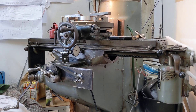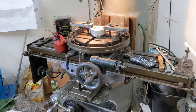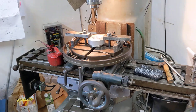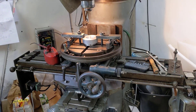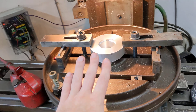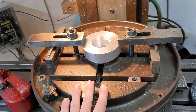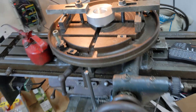The little bit of backlash would mean the holes aren't quite where they need to be. I was going to go around my mate Matt's today and borrow Optimus Prime — his CNC Bridgeport equivalent with ball screws — but then I thought, no, let's go old school. Let's see if we can do it on the rotary table, twiddling knobs by hand today.